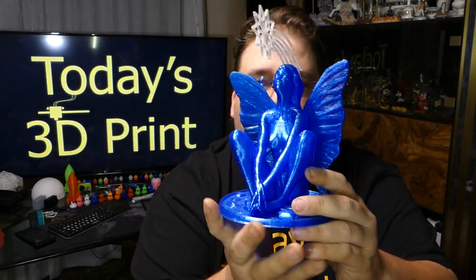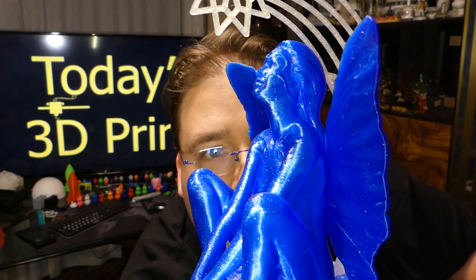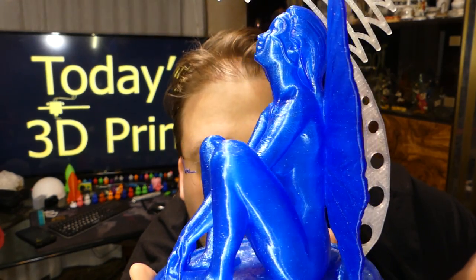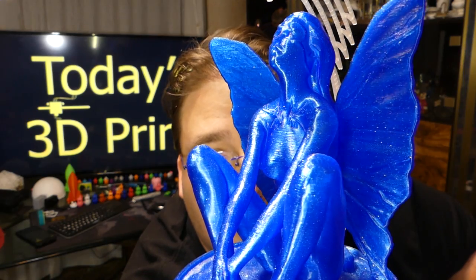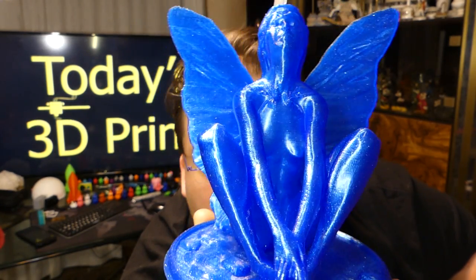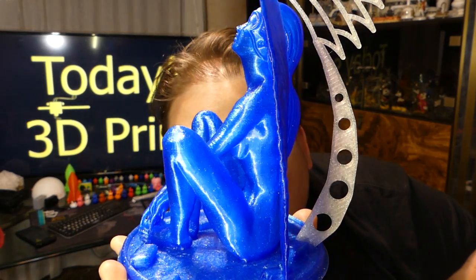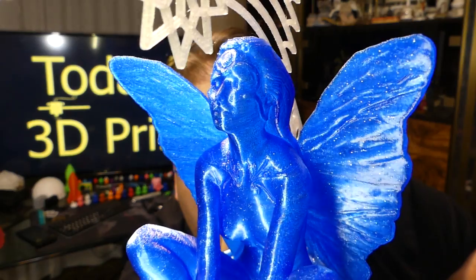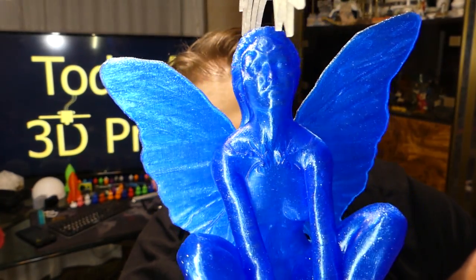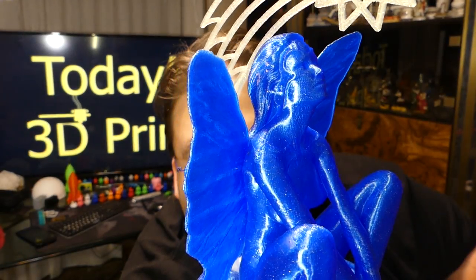I'm going to be quiet for a moment and show you some close-ups of this model, because it is one of the most beautiful models I've ever printed. It was designed to be 3D printed without support. You can see her chest and breasts underneath there — no support — and they printed clean. There's no stragglers, no off-put lines. This is on the Ender 2 with no part cooling fans, so this print was truly optimized for 3D printing. That's one of the reasons her hair and wings interact and why the wings go down to the ground — so all those parts can be supported, and this whole thing can be printed without any support. FantasyGraft, you need to set up a subscription list so that anytime you make something new, people who subscribe can get it, because I'll print damn near anything you design if you keep making stuff like this.